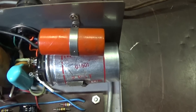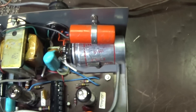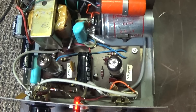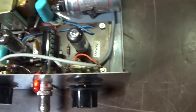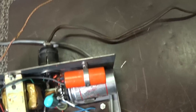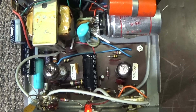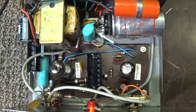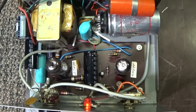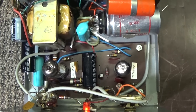The unit has good tubes in it. That big silver thing is actually a vibrator — if you had the right power plug, this thing could run DC in the car, but I wouldn't recommend putting the old guy through a vibrator on DC. Basically, the two tubes: the one on the right is an audio amplifier and the one on the left is an audio clipper. The purpose of the clipping is to take off the top peaks so you can push it a little harder, like a compressor — it thickens the audio, and thick audio sounds louder than peaky audio.